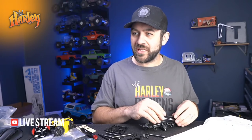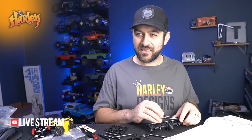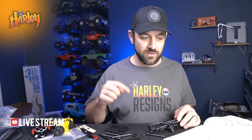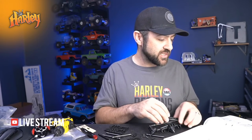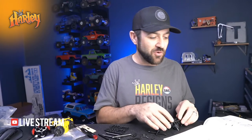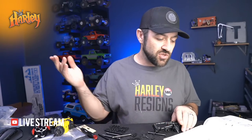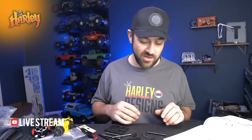Robots are cool, but inserts still need to be changed. You mean tools? The new machine, well, basically any of our machines, we run tool checkers, but we have in-carousel tool checking, and this new machine has in-carousel tool checking and a tool setter on the table, so we make sure we don't have a breakage. But for the most part, we run lights out. So leave on Friday and stuff is still running on Monday morning, as long as you don't have any tools break. Usually we have people go check on Saturday, but yes, it is all about automation. If it's not automated, don't want it.